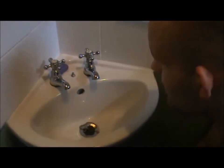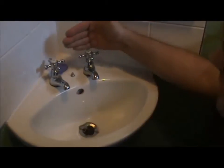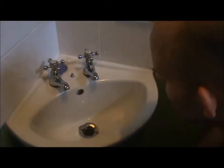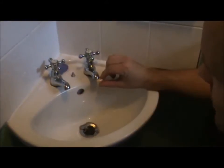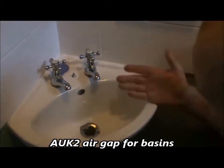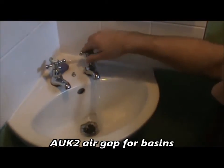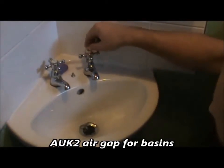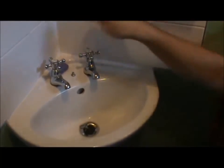Here we've got an AUK2 air gap. This is a capstan head — you can see the cross on the head of the tap — and there's 20mm clearance between the outlet and the spillover level. It's chrome, turns all the way, and has a washer inside. To take the head off you'd simply unscrew the head and take the grub screw out.